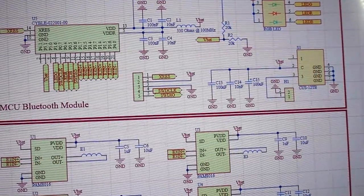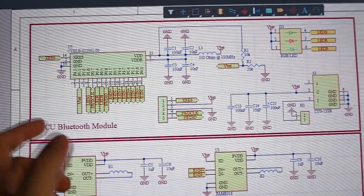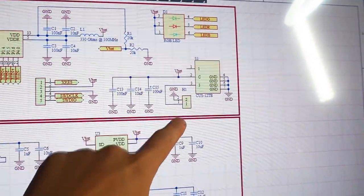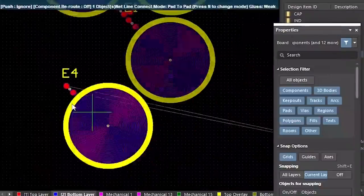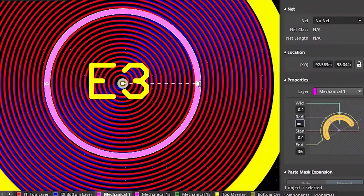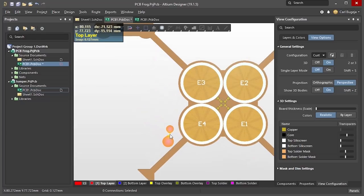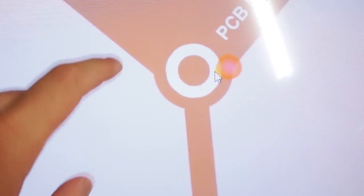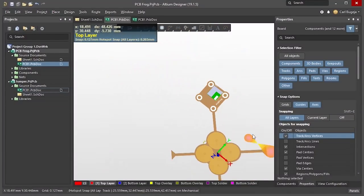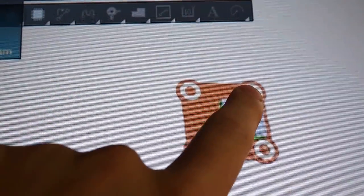To prove this concept I'm going to keep it simple. I'll use the same Bluetooth modules I use for my other projects, an RGB LED, a switch, and H-bridge drivers to control the coils. This board is going to be split into two parts: the area of the coils and the region where the electronics will be placed, connected by a flexible section. This board can't just be connected with one arm, so instead I made four which will be soldered to those parts.